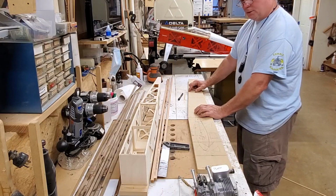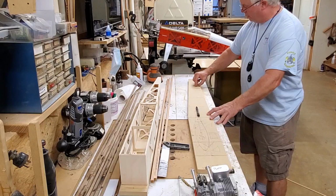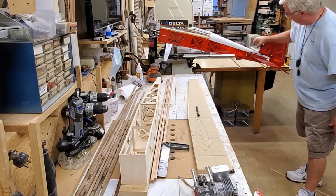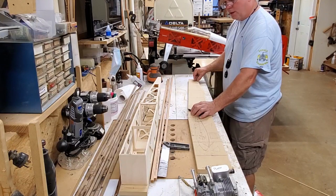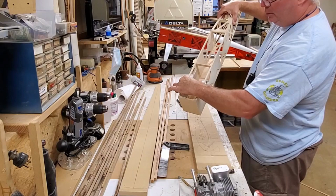3 6-inch sections of lightning holes here, and then that'll be left solid. And I think we'll even put a lightning hole up under the horizontal stab here, because this area right here is so beefy and so strong because of this horizontal stab in there. You're never going to break the fuselage back there. It's never going to break in here. So we can take as much of that meat out as we want and still be incredibly strong there. And we'll look at that in just a little bit, how much room we actually have. And then, of course, on the front up here, we want to make sure that we leave enough room, enough meat there for this aluminum bracket to epoxy bond to.